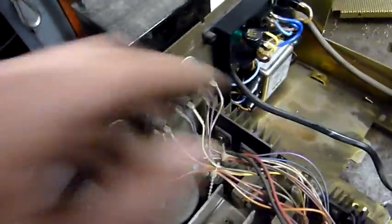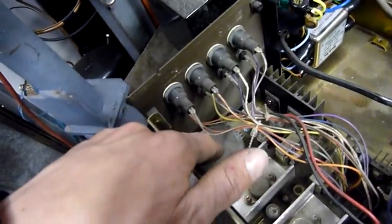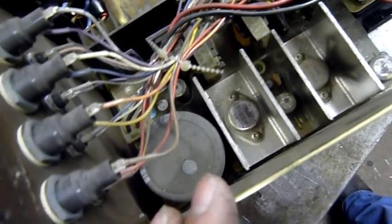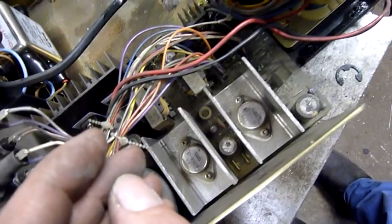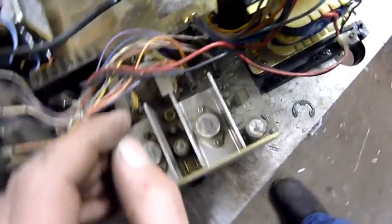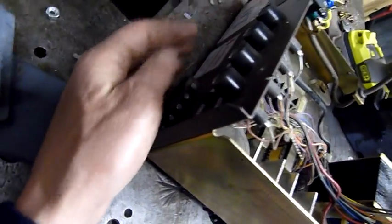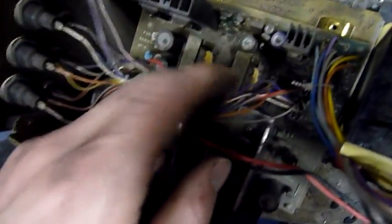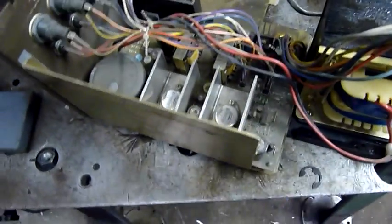I think it's a linear power supply. It's not switch mode. You could call it a well-regulated linear power supply because it's got two half-wave rectifiers there, a 22,000 microfarad 50-volt cap, and a Sanken SI-8153B and an SI-8053B. So 8153B and 8053B. One will be 12 volt, one will be 5 volt. And the 30 volts coming straight out here will be straight off the transformer. Not sure whether 20 volts would be dropped down though without a reg. Although there are a couple of small transformers here. So there's a bit of everything going on.